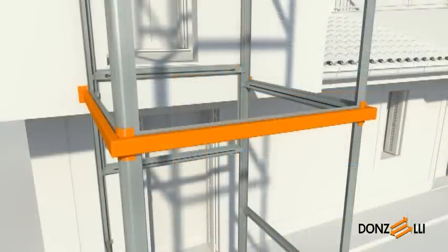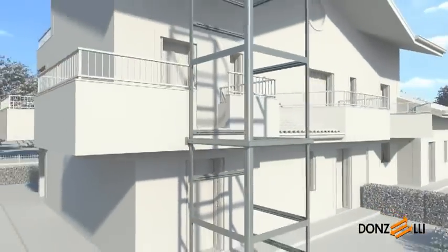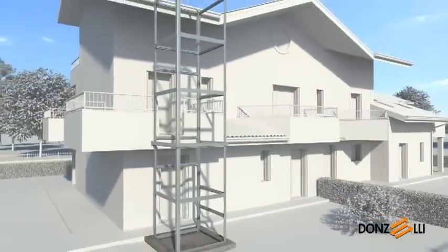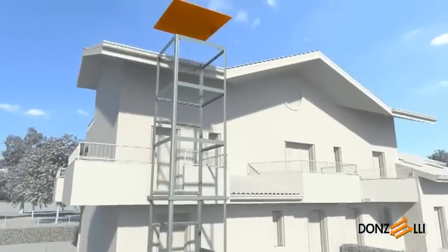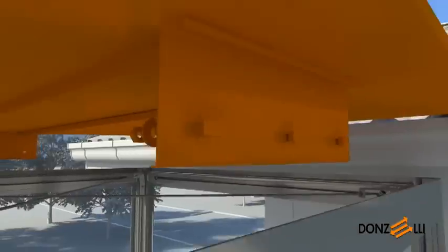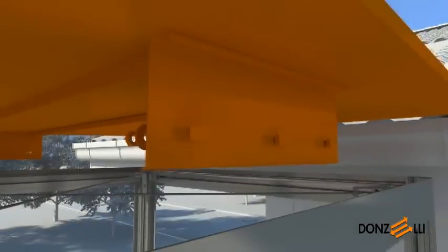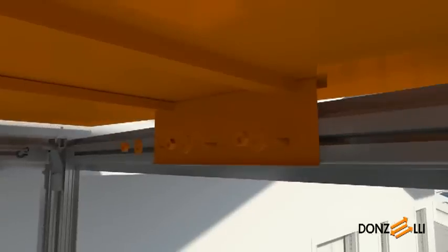The shaft is now vertical, perpendicular, and permanently secured to its base and the building. The roof structure is delivered pre-assembled. To fit it correctly, first insert the hammerhead bolts into the holes provided on the wings, solidly mounted on the underside of the roof. Then fit the roof, making certain that it slopes in the right direction. Fit the heads of the bolts into the seats provided on the end crossbeams, then tighten the nuts to a maximum torque of 30 Nm.